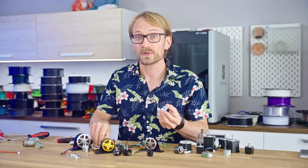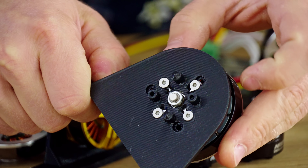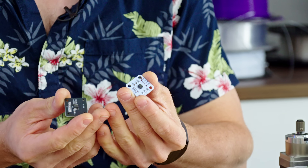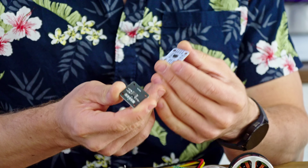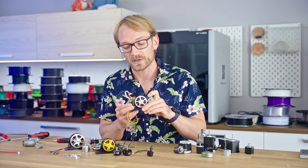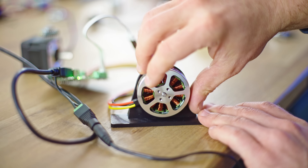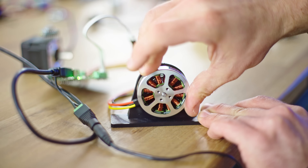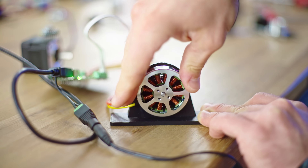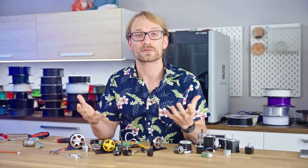The kind of encoder that SimpleFOC or platforms like ODrive typically use are magnetic encoders, where you attach a magnet directly to the motor shaft and a separate chip measures the exact rotational position of that magnet. Like any servo, this allows the system to work in closed-loop mode. If there is an external disturbance — like me moving the rotor — a closed-loop system can detect that and compensate for it, where an open-loop system, like a typical stepper motor setup, would just lose a couple of steps and never realize it.